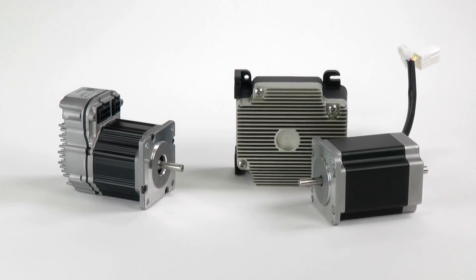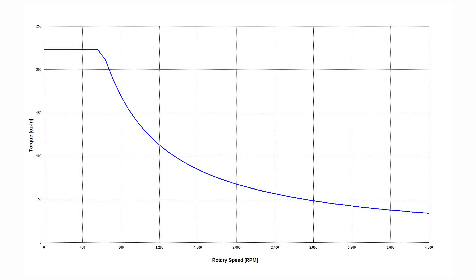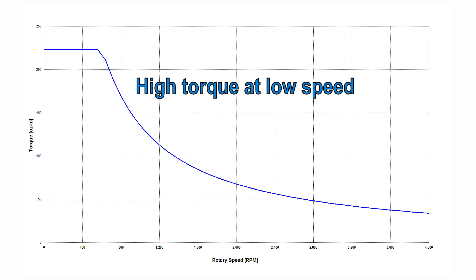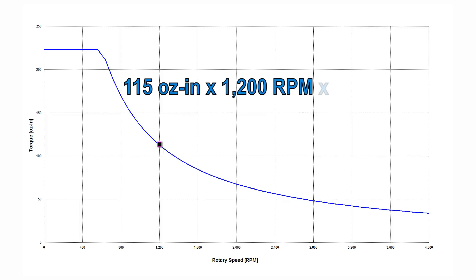When comparing servos and steppers, a lot of people forget to compare systems of reasonably equal power. Obviously, you want to be comparing apples to apples. Unfortunately, stepper motors never publish their power ratings, so you have to calculate the power from the torque speed curve. Here's the torque speed curve for the ClearPath SDSK 2310S motor, for example. Notice that the ClearPath SK series servo motors have been designed to have torque speed curves that are similarly shaped to stepper motors — high torque at low speed — to allow driving lower speed applications without gearing. Here's how you calculate the power: pick a point on the torque speed curve somewhere around the knee of the curve to get the maximum power point, then multiply the torque in ounce-inches by the speed in RPM times 0.00074. That will give you the power in watts. Pick a few points to do this on the curve to make sure that you get the maximum power point.